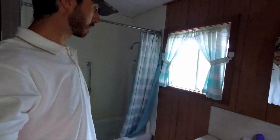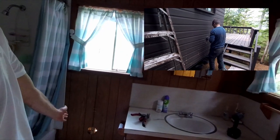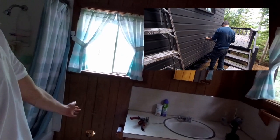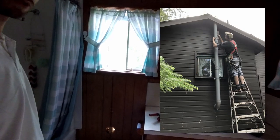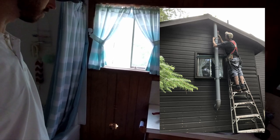Looking at the venting and assessing near the sink, we have to go through the window area because the owner does not want to move the sink. Usually you might have a little space to shift the toilet left or right to miss any studs — at the edge of a window you'd have a double stud. These are all things to consider when looking at space availability. In this case, we have no other option but going through where the stud is, so we'll need to make modifications and ensure everything is supported when the job is done.